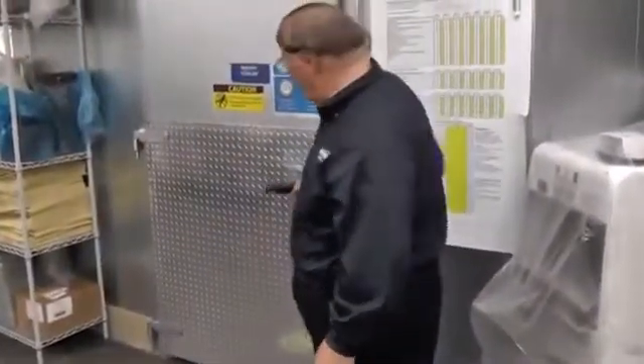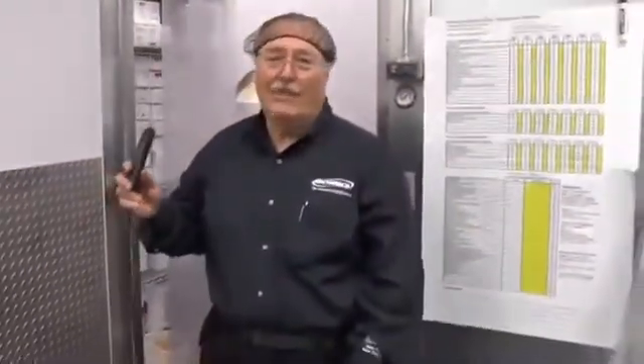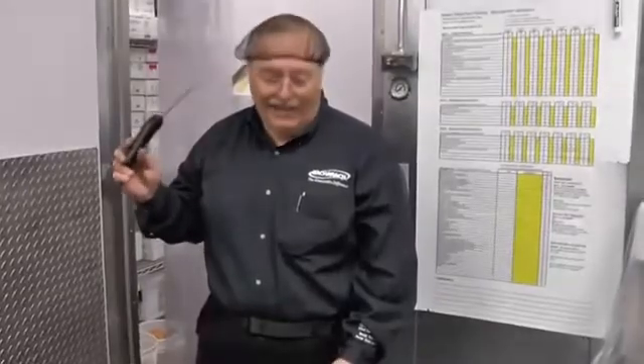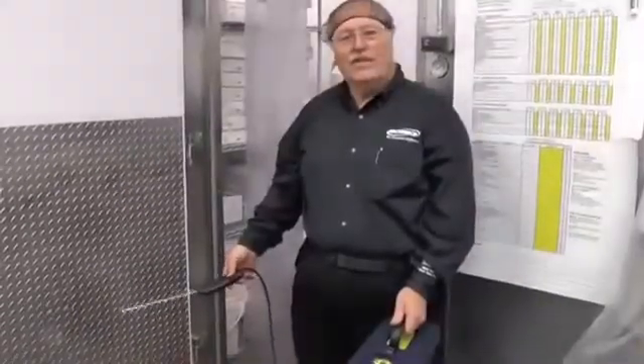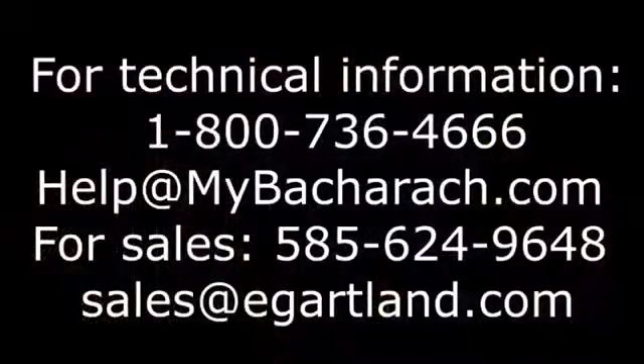I'm going to check the bakery freezer since we're in here. Check both high and low. Not to our surprise, we got the same background we got from the pan release because we're storing baking pans in there — they have that same refrigerant in them. We have refrigerant, but it's actually from our baking spray and doesn't indicate a leak since we've got the same level of refrigerant detection ambient in that room. Just to be on the safe side, once a year you ought to verify there isn't any actual leak in there by pulling everything out, cleaning the baking pans out, and checking for leaks in this room.